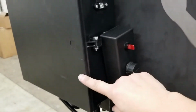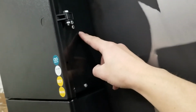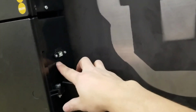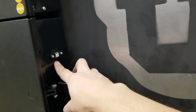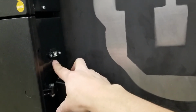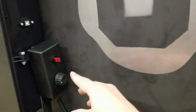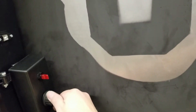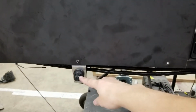A cable is supplied in this lower box for the USB connection that goes to the Arduino Mega that's with all of the electronics. For being able to control over serial, you should be able to connect and control off of serial without having to change and upload the sketch. Just connect and open the serial monitor in the Arduino controls. It is generally expected that you will turn the fan array on to some value before using the igniter.